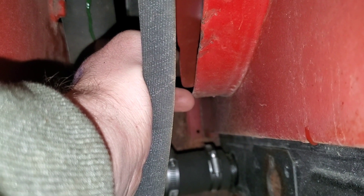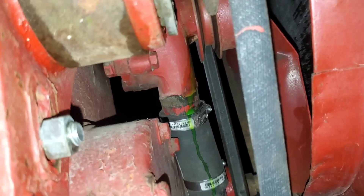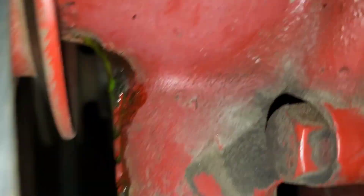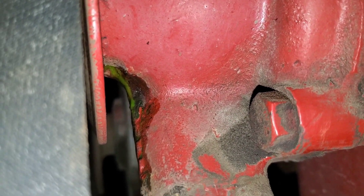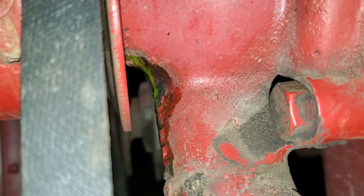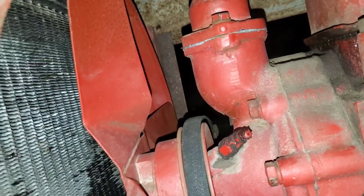We still have a couple of 1394s — one of them belonged to NASA at one time, the other one belonged to the Air Force. On the NASA one, somebody had the cab heater core leaking and kept dumping stop leak in it until there was no water left around cylinders two and three, and it got hot and locked up. We bought it and fixed her up — one of our favorite tractors.